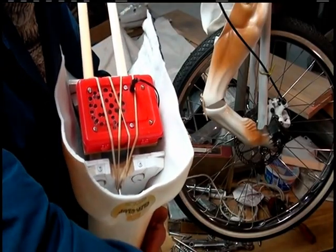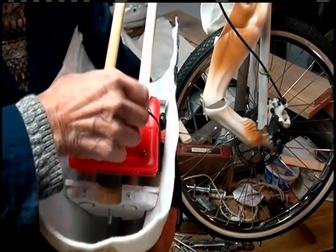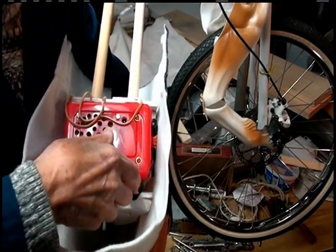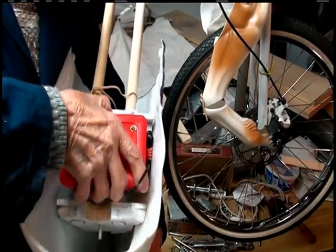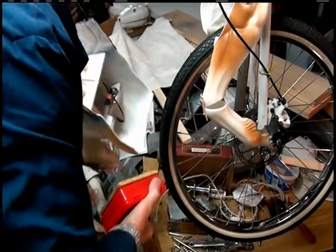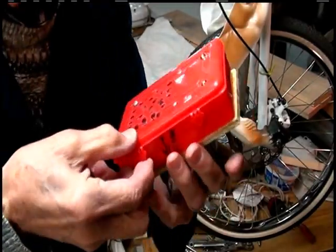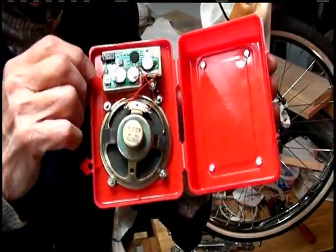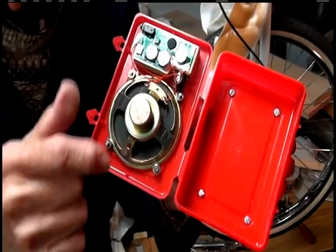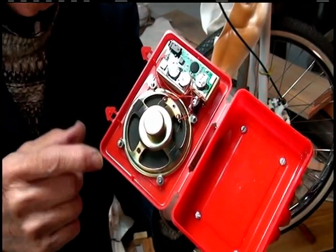Here's a little detail on the sound box. I have a couple of rubber bands on there to stabilize it, and there's a plug — that's the actuator switch so you can take it out. That's the little amplifier/recorder board I showed you earlier. I added a larger speaker to get better sound — it has a paper cone compared to the plastic cone that was on the original.